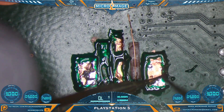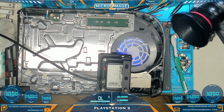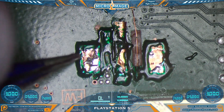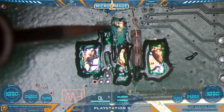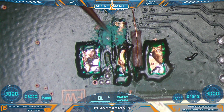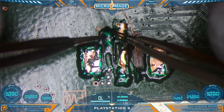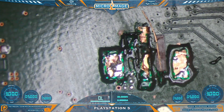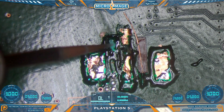Give this one another quick tack because it has a little bit of lift to it — I don't want it to cure lifted. The UV lamp is back on there. We're going to step away for 5, 10, or 15 minutes and just let it thoroughly cure. We don't want a partial cure or a light cure — we need it to be rock solid, nothing moves. Oh crud, it lifted. That is not what we wanted to happen. Now we need to re-cure that one. I don't know how you popped up, but it wasn't cool. Take our laser, tack it back down, stick the lamp back on there, and let that cure again thoroughly.